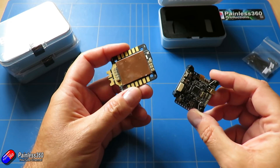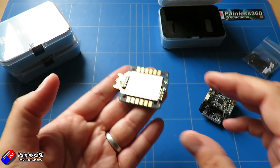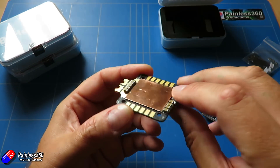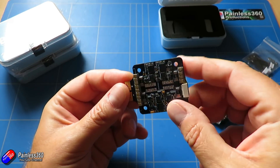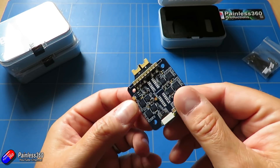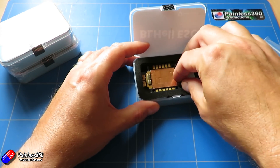There's an awful lot of choice coming out now. This thing is quite heavy — it's actually quite beefy. It supports 3 to 6S LiPo, 35 amps continuous current, and a whopping 50 amp burst. The weight is about 17 grams, so there's a lot of material in there to make sure it can handle the current.